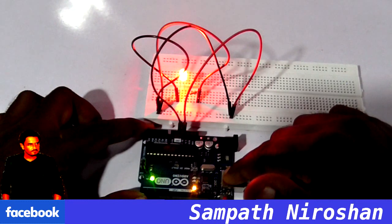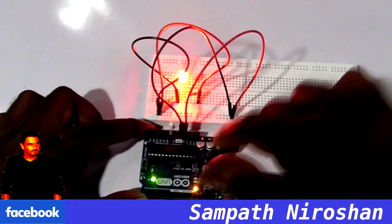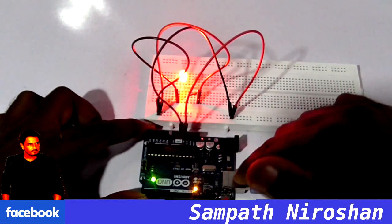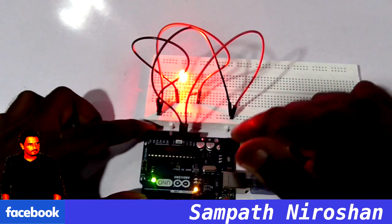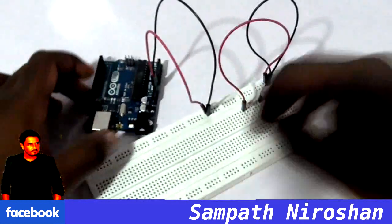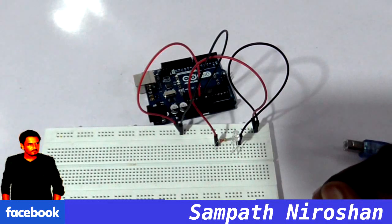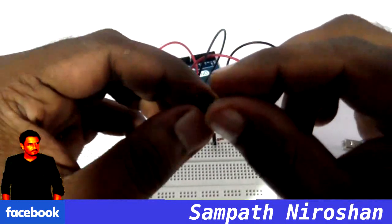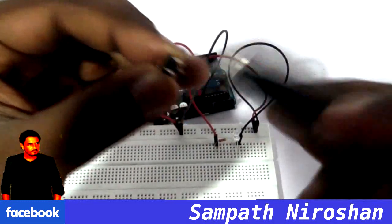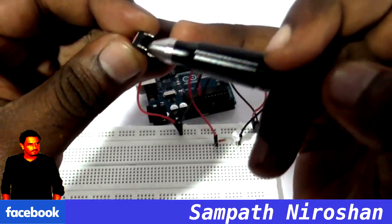But you don't have control over this yet. Let's try to fix a switch to control this LED powered with the Arduino board. Before any further modifications to this circuit, first thing you need to do is unplug this — otherwise any unusual voltage is going to damage your board. We are going to fix a switch to our breadboard. Now for that you need this switch right here. If you see the 4 pins in this switch, they are connected in a fancy way — these 2 pins on one side form one switch, and the 2 pins on the other side form another switch.